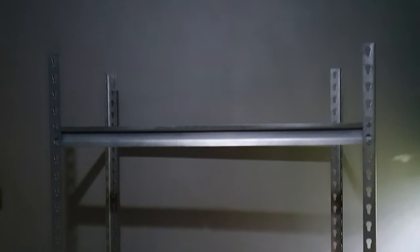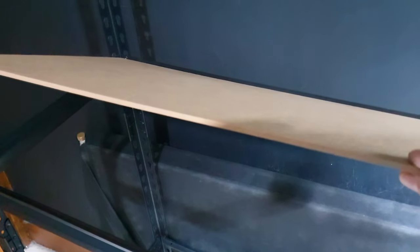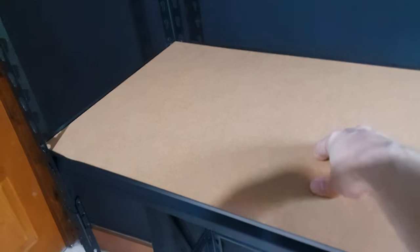Something I've noticed: the boards that come with it fit perfectly fine, but they're probably only about 3mm thick. Because this shelving unit is about 80cm across and the tank is 60cm, it's going to sit in the middle — and I think the boards are a bit too thin. I don't think it'll push through, but it'll definitely bow. So I think we're going to need to go and get some better plywood for the shelves.